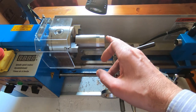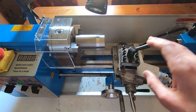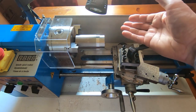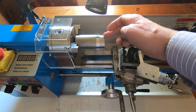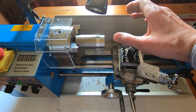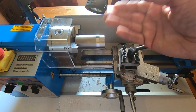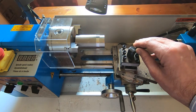I've got a piece of titanium in the chuck, and all I'm going to do is turn off maybe half a millimetre, generate a bit of swarf, and we'll see if it will actually burn. The danger I'm talking about is that when you machine components, you quite often end up with the final component being only 10% of the original material — sometimes less — so you end up with a huge amount of swarf. That can very quickly build up under the bed of the lathe, and it's something you do need to keep cleared out. Often it's a danger of it thrashing around and injuring you, but with titanium the point I was making was that it can actually catch fire.